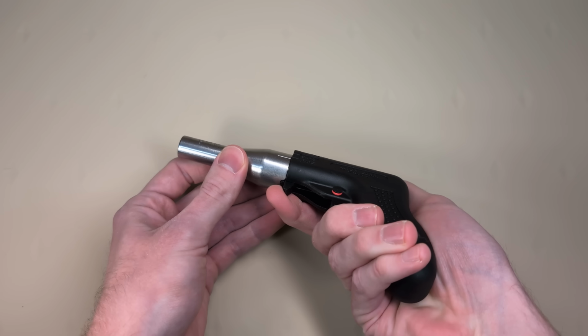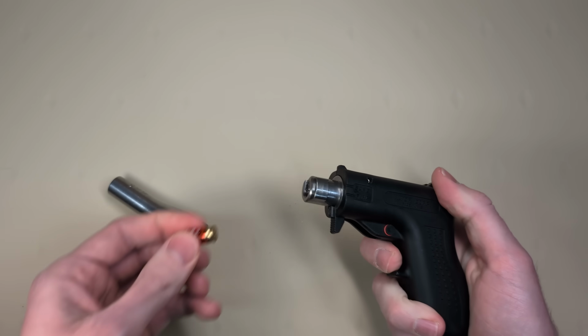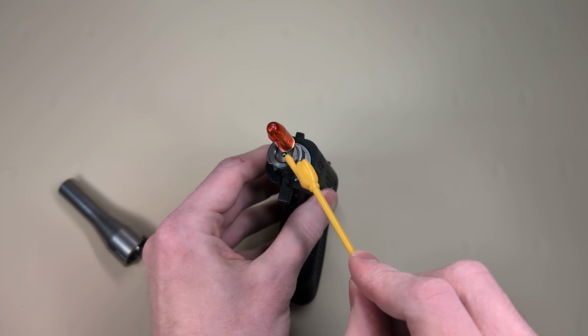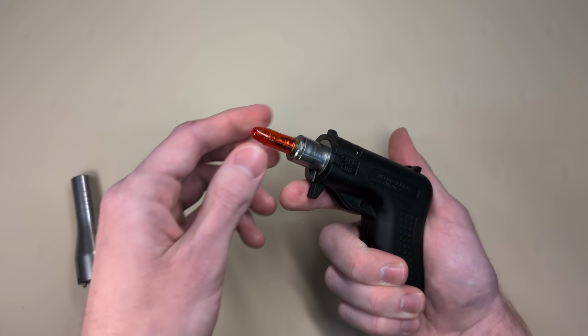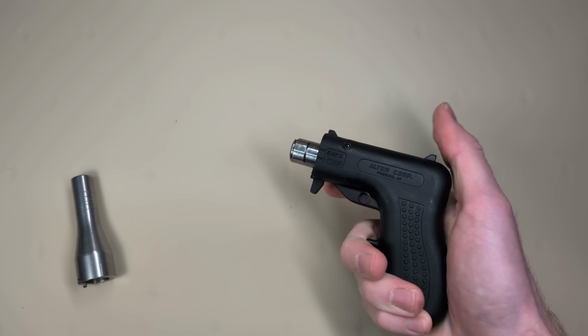Watch. To load it, you pull the trigger slightly, yes really, and you rotate the barrel from the fire position over to safe, and then further to the disassembly position, where the barrel can come off. Notice how at rest, the striker protrudes through the breech face, preventing me from sliding a cartridge all the way on. So now I have 3 options. 1, I can pull the trigger slightly to get the striker out of the way, which is nerve-wracking. Detonating the cartridge at this point would blow it up like a firecracker, sending shrapnel everywhere.